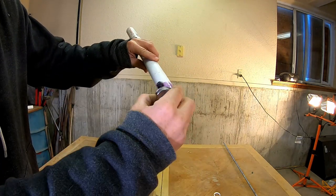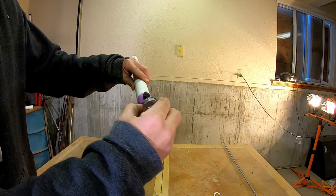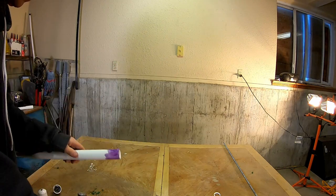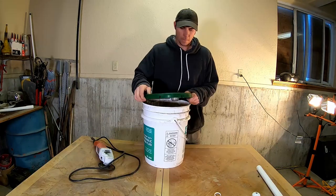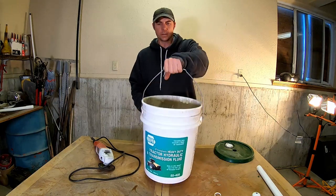Again, guys, always do this in a really well ventilated area. This stuff will mess your lungs up. And do not get this stuff in a cut. Oh, this purple primer, there's nothing worse than that. Make sure you always hold these down because they'll try to push out. Here we go. All right, now that we got that piece done,